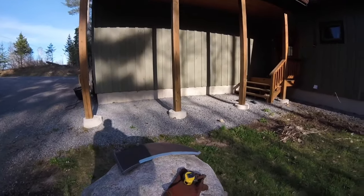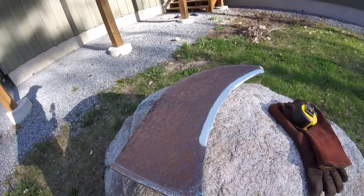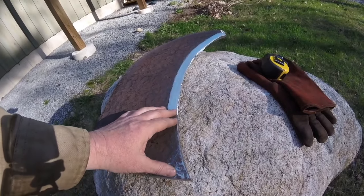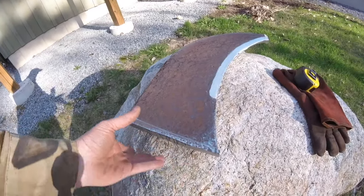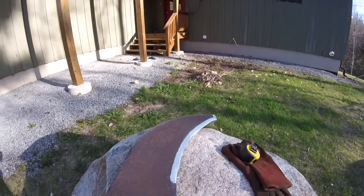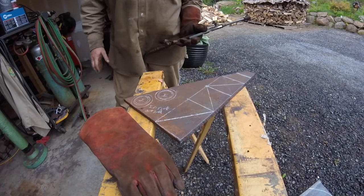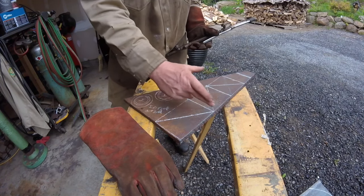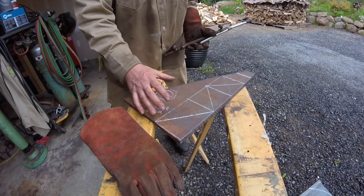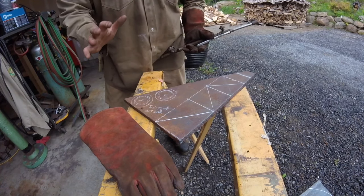Next is going to be working on the gussets — there's gonna be two gussets on each side for strengthening, and that's why I didn't keep coming up with the blade, since that would just be in the way of cutting anyway. Then there's the plate and of course the mounting brackets that are gonna go on the excavator itself where the pins go through. One thing I like to do when I start cutting things out is always start with gussets — they don't have to be perfect, you can grind them flat. You're not cutting on the inside or outside of your line as much as those tabs are gonna have to be perfect. It's something I try to do: start with something that doesn't really matter, kind of get my groove on and go from there.